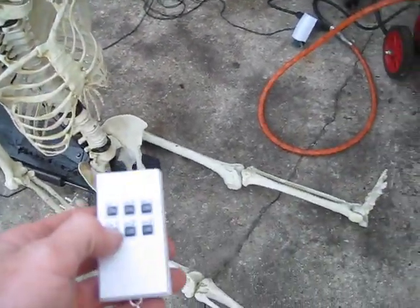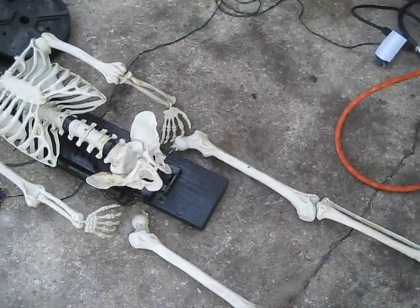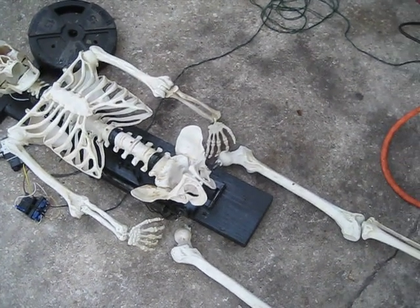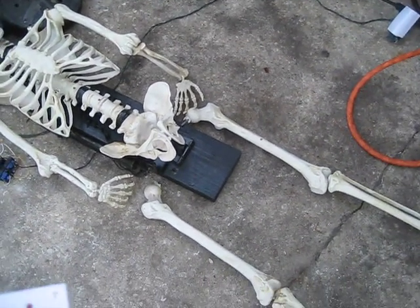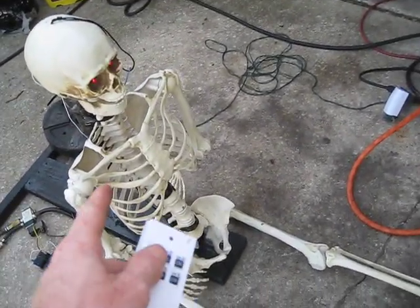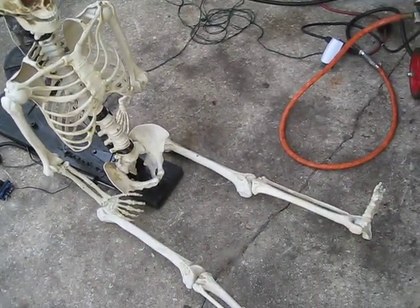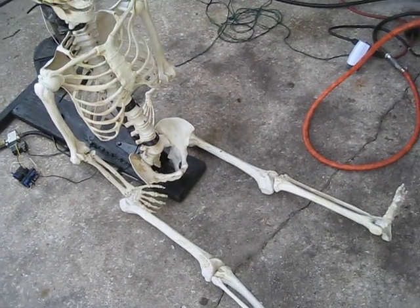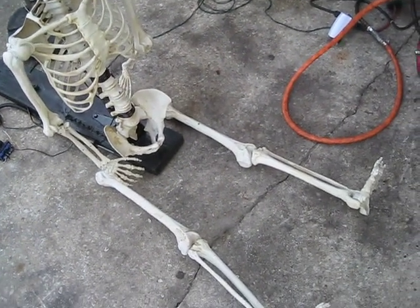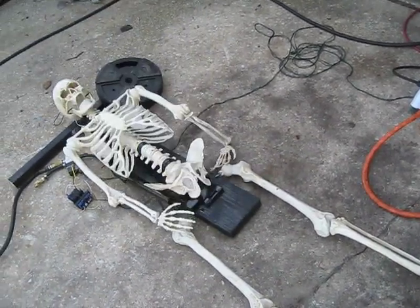Right now it's on — you can see the light indicating it's on, and he's up with the eyes on. So we hit the off button and he retracts back down. This is regulated to about 60 psi — you want to play with it depending on your prop. So if we hit the on button, he pops up, the eyes come on, and he'll stay up until either I run out of air pressure or until I hit the off button, which can be handy. Hit the off button and he goes back down.